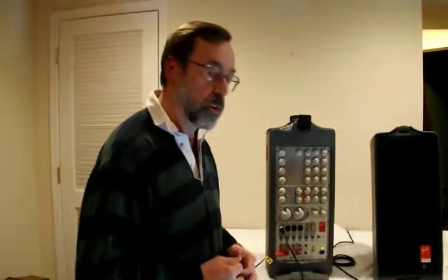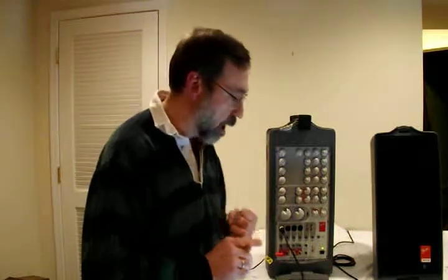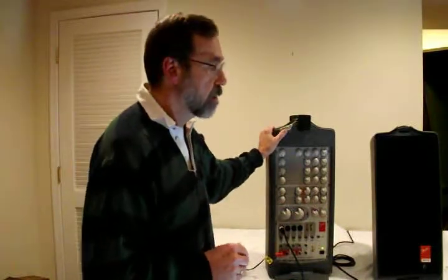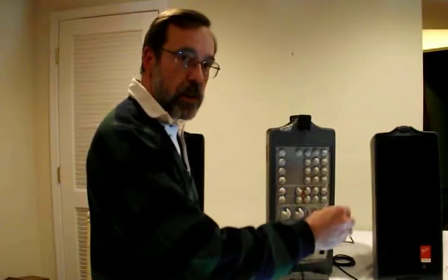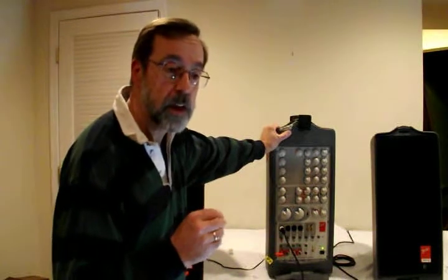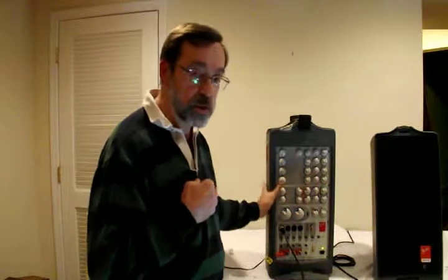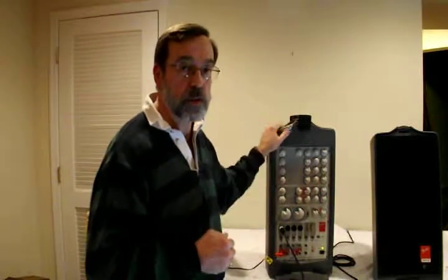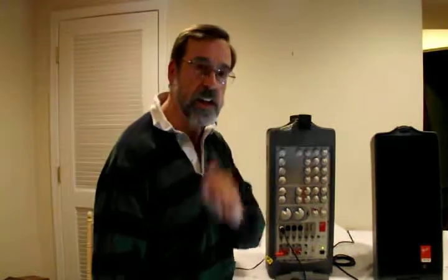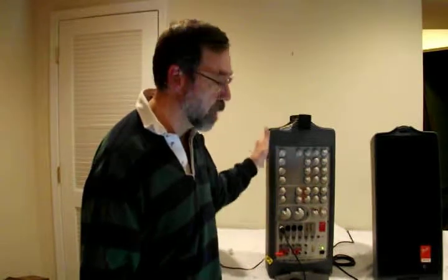The third thing to avoid is the big fire. This equipment can overheat and destroy the amplifiers. You avoid that by using the correct wires for the correct plugs and not adding more speakers than the power amp is capable of handling — don't gang speakers together one after another. This Fender system is meant to run four speakers only. We've damaged Fender and other sound systems by driving more speakers than intended, having to repair or throw them away. Also make sure you're using speaker wires to run between the power amp and the speakers.